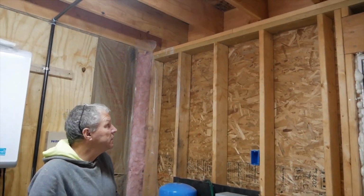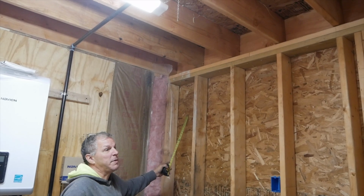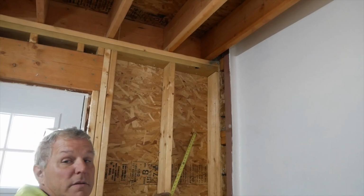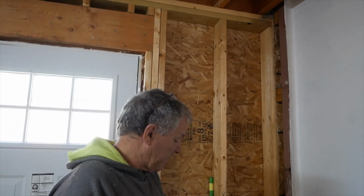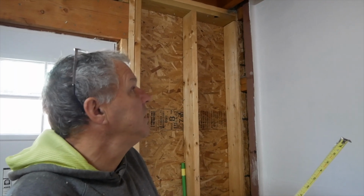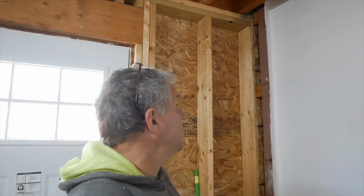So you're going to put them all where? The intakes are going to go here in this bay, and then we're going to put our exhausts all the way in this bay. And we have 2 more exhausts too. Where are those going? Well, we have the dryer exhaust, which is probably going to go down low, and we have the exhaust for the boiler, which is going to go here. You forgot the stove. Oh, the stove vent. We need a stove vent, right? That's another 4-inch pipe, yep. I think we could do that one through the rafters and maybe upstairs through the closet out there. Yeah, high. Well, we'll see. If we got room, we'll shove it here too.